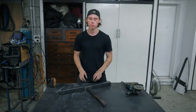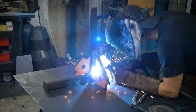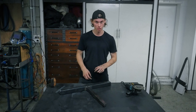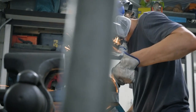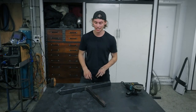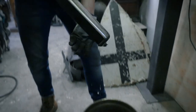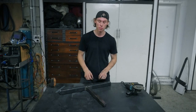We've drawn down our base piece and forged in our taper, and you've just seen me tack it all together. Now before we put in the proper welds to hold it all together, there are two things to take into consideration. Number one is the 45 degree bevels which are ground all the way around the top of this piece. The second thing is to give this a preheat — that lets the weld burn in and wet deeply into the steel, ensuring we get maximum penetration so these bad boys never come apart.